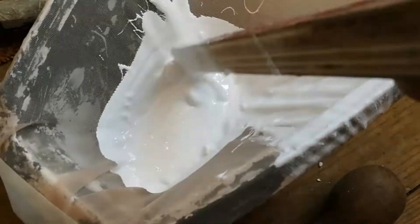And that way I have the remains of the tin — it doesn't go to waste, I get bit-free paint. Unfortunately when you leave a tin of paint, if there's the slightest air gap you'll get a skin on it. And despite your best efforts at trying to get it off, it quite often leaves bits, and you don't want that on your paintwork.